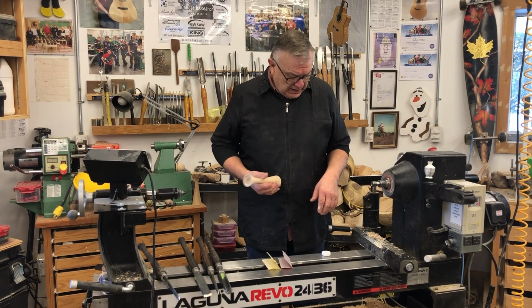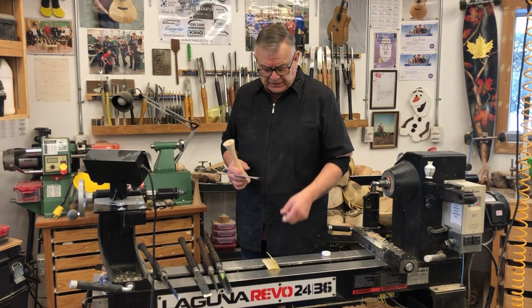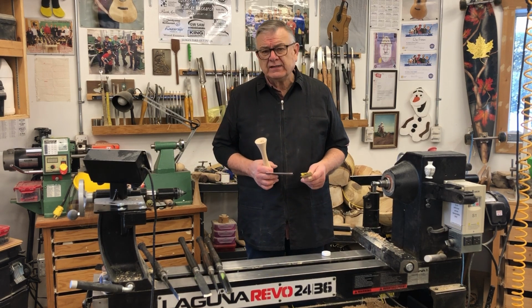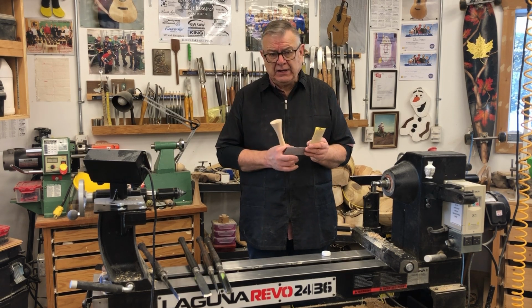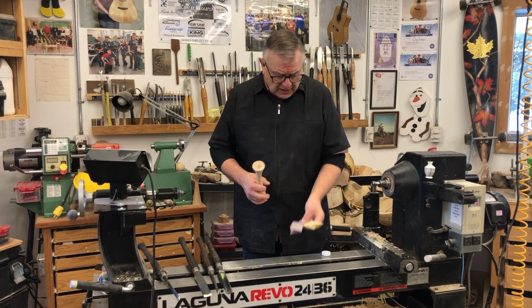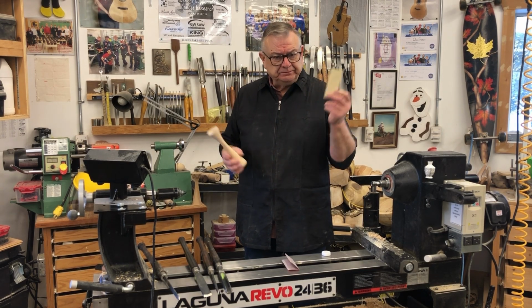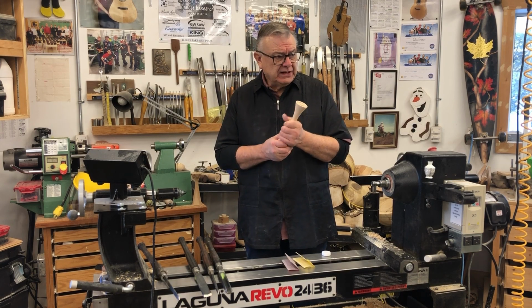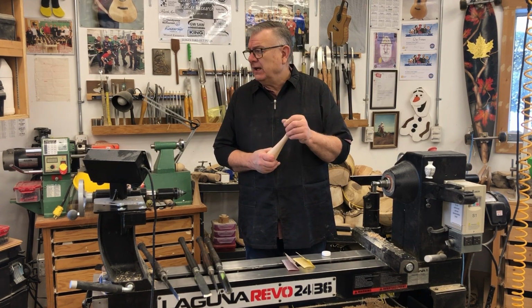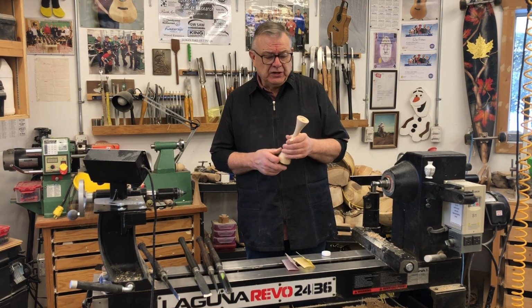And because of my influence at school, we were always trying to save money, so we only used 100 and 180 grit paper. Now, according to many finishing experts, 180 grit paper is really quite good. 220 and 320 will make it feel better, but there's debate among the sanding crowd, so whatever you do, just do.